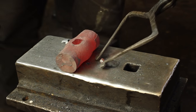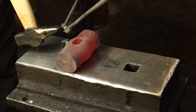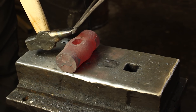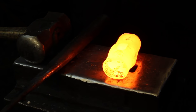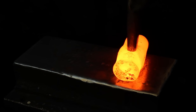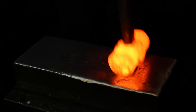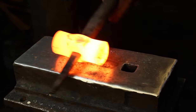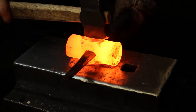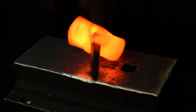There is a beautiful freshly punched plug. You can see it is the negative of our punch. So now we're going to go in the other side, drive the drift till it fills the eye. And then we're going to go ahead and hit to the high side of the cheeks. This is going to create three valleys.